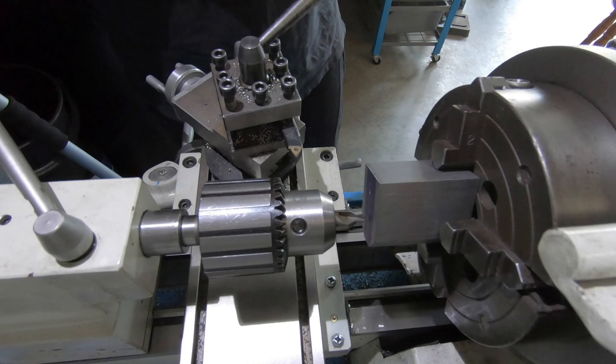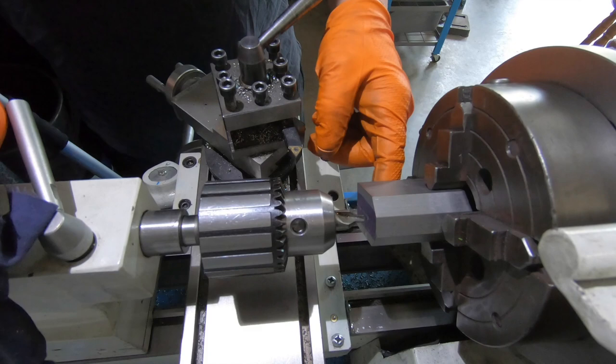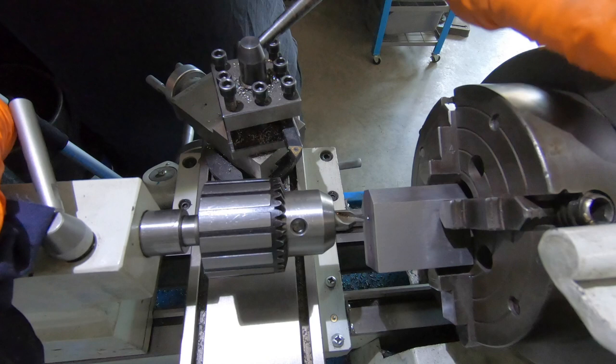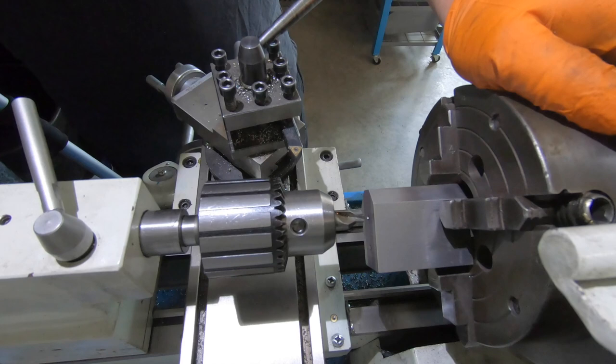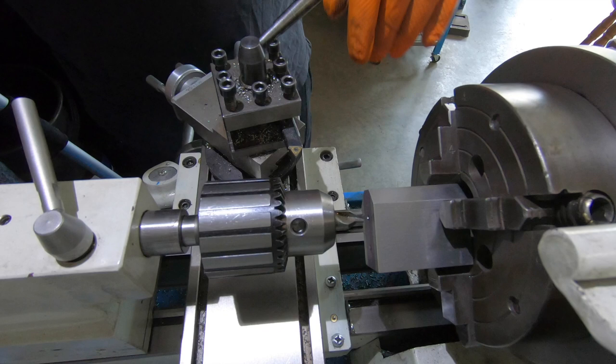Finished on the shaper for the time being anyway. I've got all of the sides machined off, this being the top and the bottom down here. It looks a lot better now. I've taken them big wings off the side. They look bloody terrible, so I don't even know why I really drew it up like that. But anyway, all plans are there to be changed, so I did. It's just a matter now of putting a 5/8 hole through the top here for the main centre.